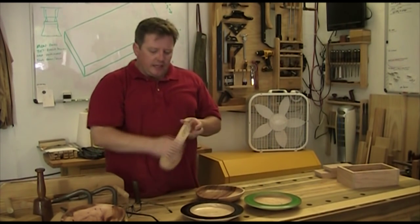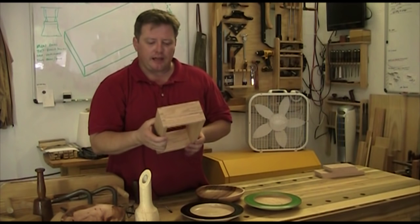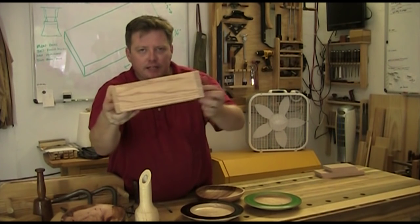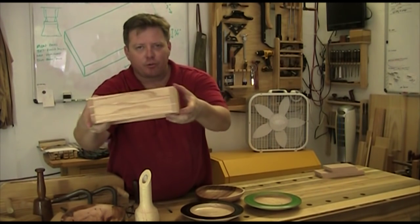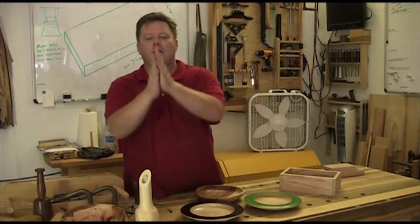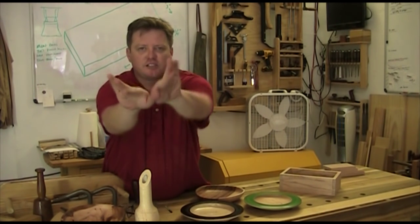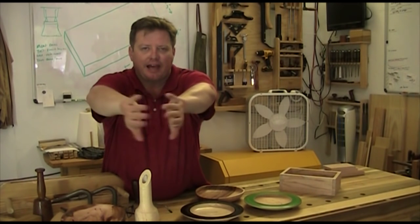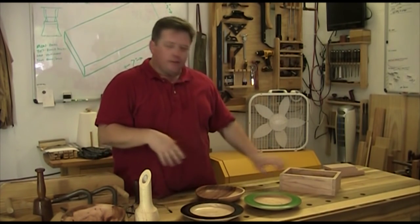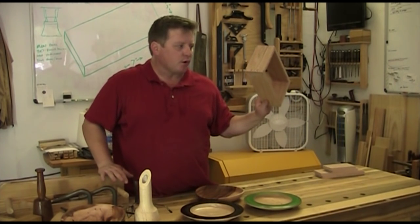I did some vases as well. Today I started working on a bunch of boxes — finishing up some commissions. One of the things I like to do on all my projects is grain match if I can. It's something that probably nobody but other woodworkers will notice, but the only way you can do it is if you split the wood. The middle section of the box is the part that was touching, so if you inverse that, the parts that were touching in the middle are now on the outside, giving you a wrap-around effect of the grain. I have about three or four of these to finish tonight.